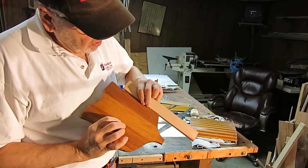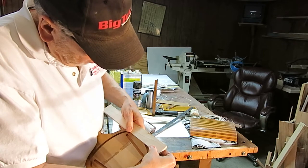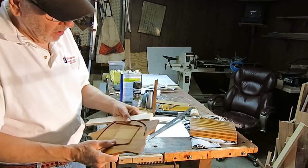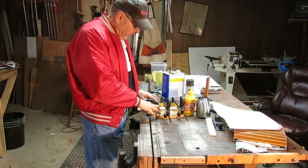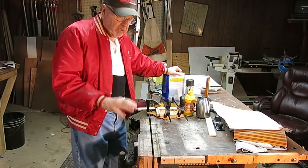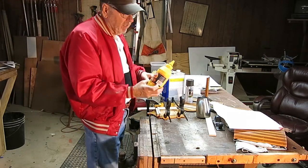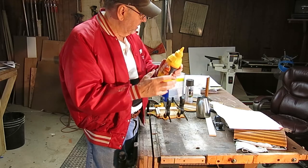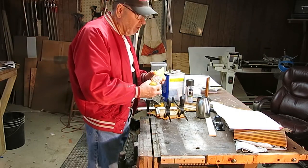Now I'm going to try to glue it flush on the good side, and then I'll have to sand it down. I'll leave the piece pretty big — I might just glue it on there like that so I can clamp it down when I rout the kerf in there. I got it glued and set up on the bench. I'm going to let that set up quite a while because it'll be very fragile — there's not much surface area there. And you can see I glued it together — mustard bottles make great glue bottles. I buy my glue in gallon jugs and these make great applicators. You can seal it up, it has a nice little nozzle. I always save my mustard bottles to make glue bottles.